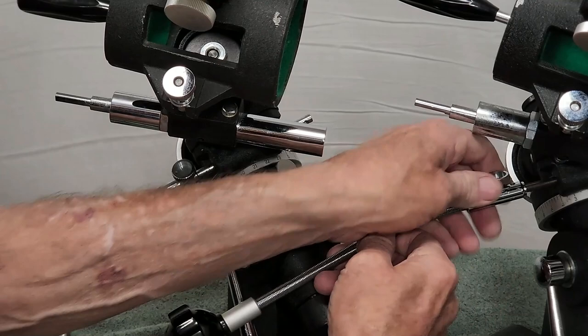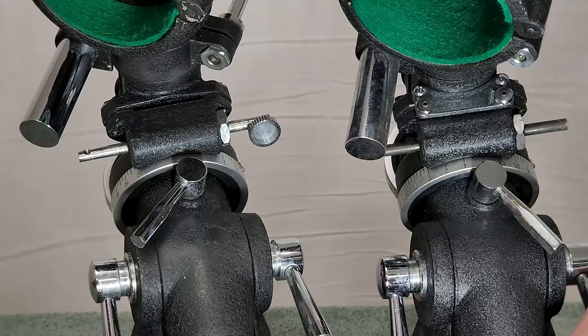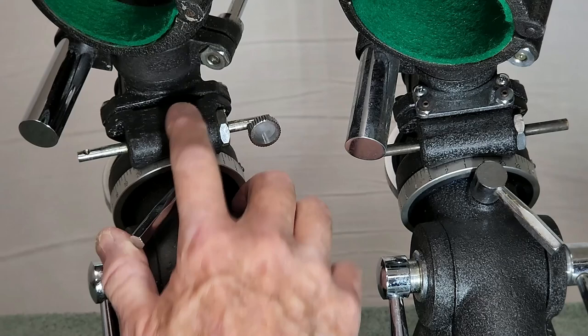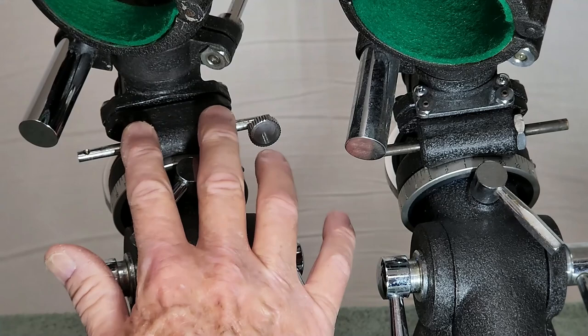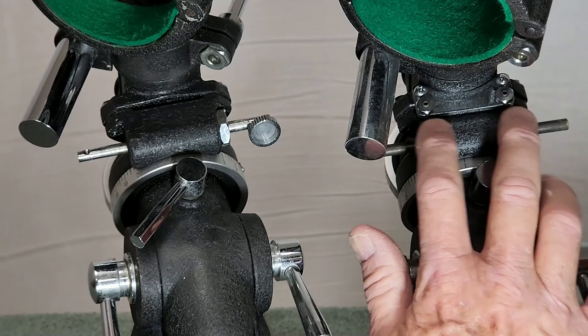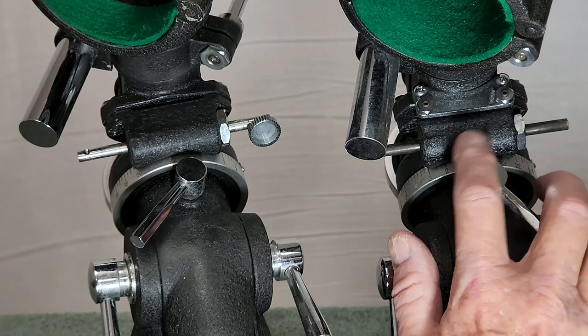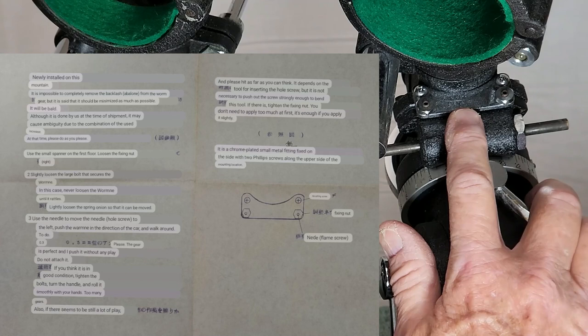This one, the slightly newer one, has a more traditional slide-on arrangement. And in both cases, the declination slow motion is a slide-on. On the old mount, this is the mounting housing for the worm gear — it goes in against the worm wheel inside there. The worm wheel has a certain spacing and it's pretty much stuck where it is. With this one, you can adjust the placement and the tension with these pressure screws here. This mechanism's only purpose is to push down on that and adjust, which allows you to adjust the backlash in the right ascension. There are instructions on a mimeograph sheet of paper for how to do that, which came with this mount.